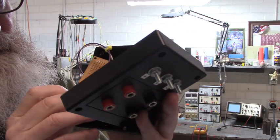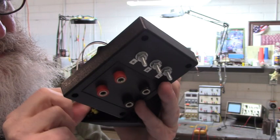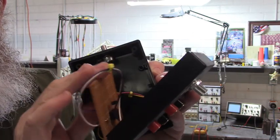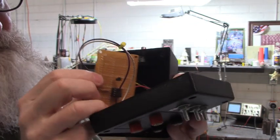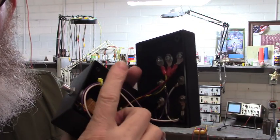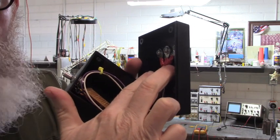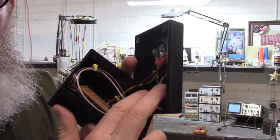Let's look inside. I don't have the circuit board bolted down, but look — there's not that much to it. There's an operational amplifier, a transistor right there, a resistor, there's the back side of the board, here's the potentiometer up here that I used to adjust that milliamp output. Here are the jacks that connect the external power supply and the milliamp output — one output to the soft start or drive, and one output in parallel so that I can monitor that milliamp output.